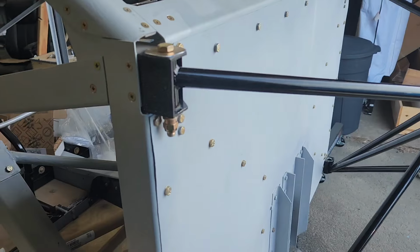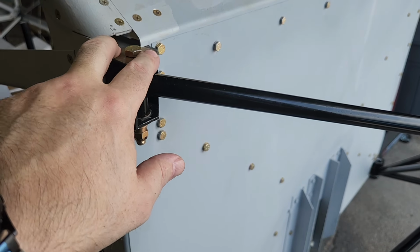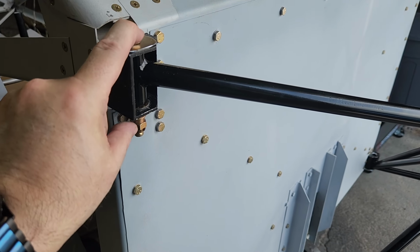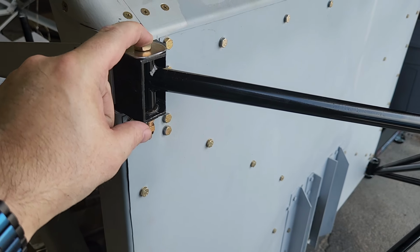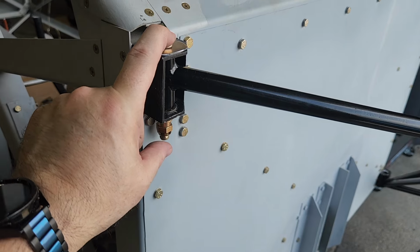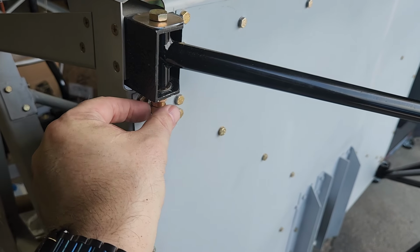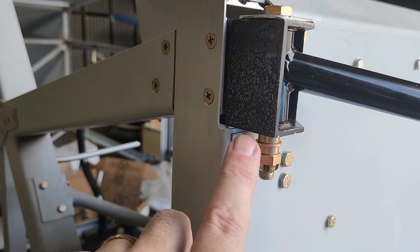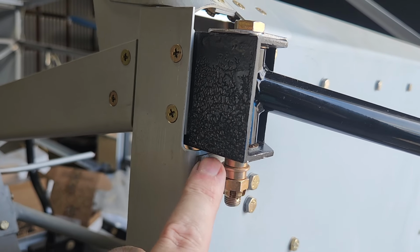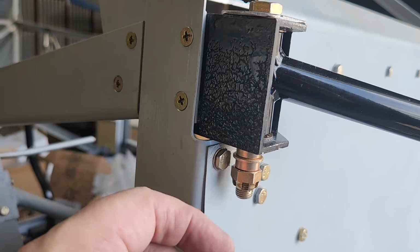The other big job is this motor mount. This is just a very large washer shaped to fit on top here. The bolt is a little on the long side, but when I ordered them, I wanted to err a little bit on the long side, maybe erred a little too much, but again, I can put a spacer in there because all the strength is where the pin is. Right now, I've just got a couple of bushings that I had laying around there to use as a spacer, but I think I'm going to make a proper one and make it super thin.